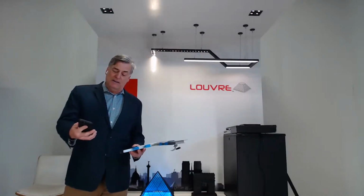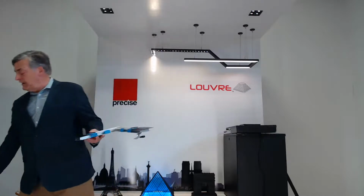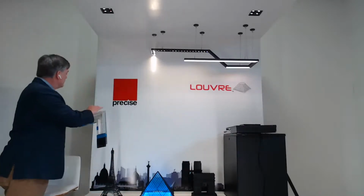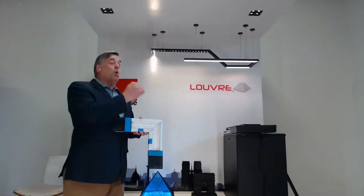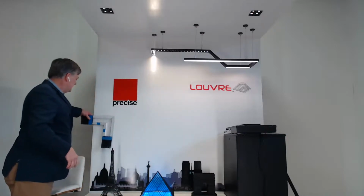There's a follow-up to that. So it looks like the Midwest is leading 3-1. This question is, does the end plate have to be there? Okay, good question. I see what he's saying. So let's say we wanted to install this starting from here and going over to the side of the room. So it would start like this. Yes, we can start the fixture at a corner or a junction of a ceiling and a wall and not use the end plate. The two sections would meet, or this would be tucked into the edge of the finished wall. I see what he means.